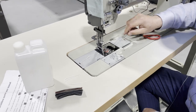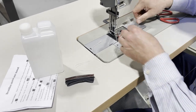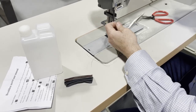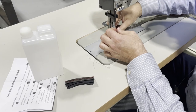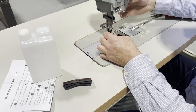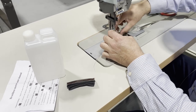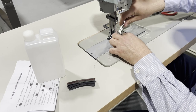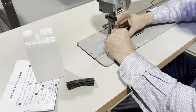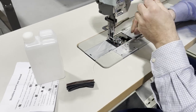The first time you're going to have a little challenge, but after that you won't have any problem. Right now I'm trying to get the needle up and make sure everything is okay. One of the reasons we're having a hard time is because we're working with very very heavy thread — 207. This heavy thread can get stuck around the hook, and then you have to take the hook out and do a timing adjustment.